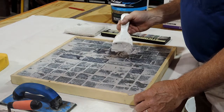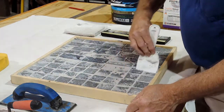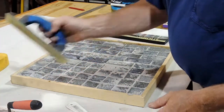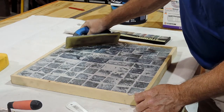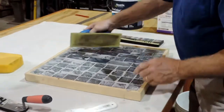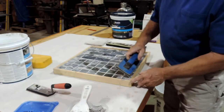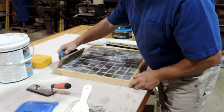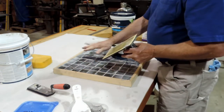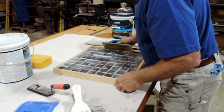I think it looks pretty good. I'll use the tub to clean my putty knife off and get any excess material off. Now I'm going to take my grout float at about 45 degrees to the joints and scrape along it, using my putty knife to put that material back. You can see how it's cleaning up and pulling a lot of material off. 45 degrees is what we're shooting for in the open part, but you'll have spaces where you have to go right tight and scrape it off.